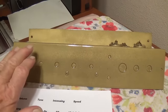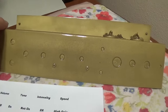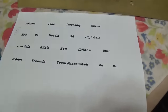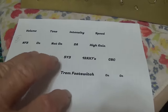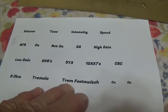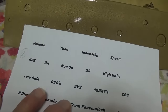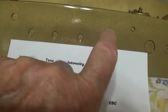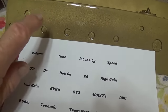Now that we have a nice, smooth, glossy finish for our chassis, it's time to label all of the controls, tube sockets, and other parts of our amplifier chassis. I have decided to use water transfer decals that are laser printed on special decal paper. Step one was to come up with a proper font, size, and boldness that suits the eye. I actually spaced out the volume, tone, intensity, and speed so that it will match the pot, so I can apply this particular decal all as one continuous strip - that way they'll all be at the same height.